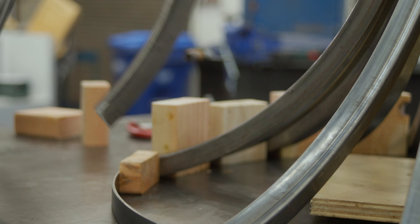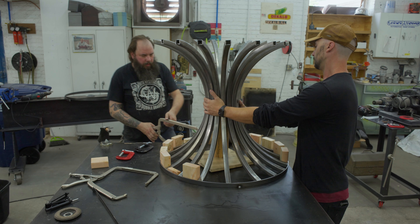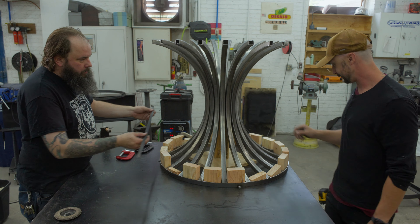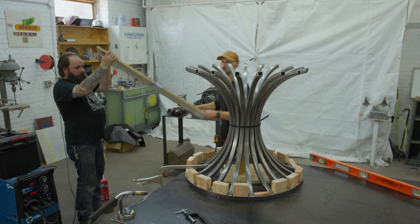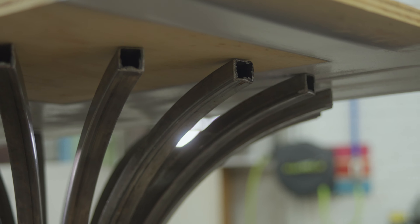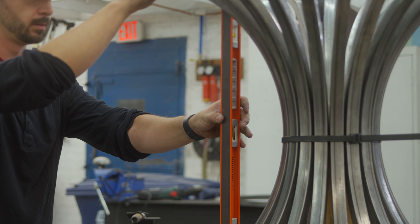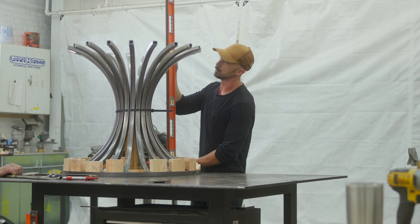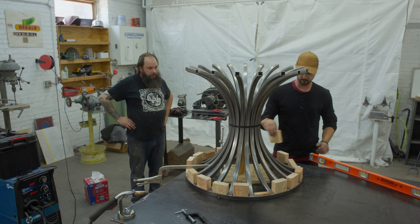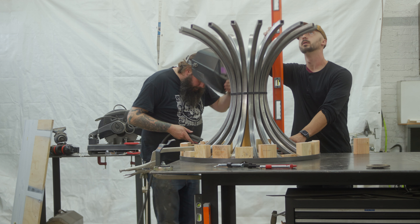We did have to make some minor adjustments to make sure the temporary stem was right in the center. If the legs are off just the slightest bit, the table is going to act more like a slide for people's drinks and food. We did a test by putting a sheet of plywood across the top to show how uniform each piece was before we started welding — there was one leg that was off, so we had to adjust that. Words I live by are measure twice, cut once — or in this case, measure a bunch and only weld once. With everything in place, we began welding the legs into place one at a time, with me measuring and Andy welding.